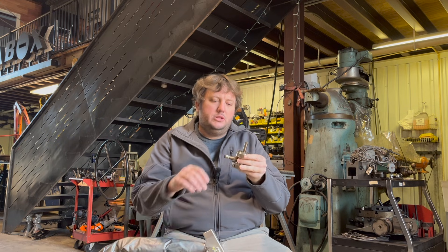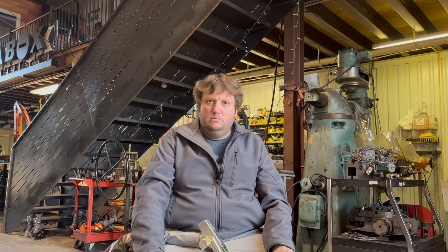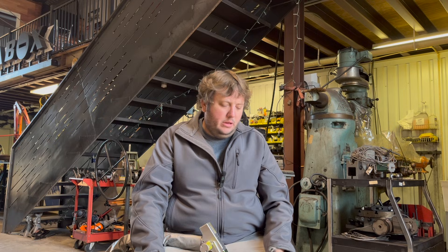My first hiccup was when I first introduced the water. The crystal I'm using was just a stand-alone crystal, and I didn't notice at the time, but the cold water I was introducing to the chamber was fogging up the mirror. As you can see in this first video, when I first put the laser to it, it broke that window because the laser was introducing heat to the window because of the condensation. So I had to change some setups, and I introduced hot water into the system instead of cold water to reduce the condensation. That helped, but I'm still getting a lot of heat into the window because it's melting seals off the crystal laser window, and it's putting a lot of heat in the chamber itself.